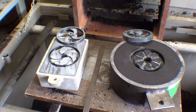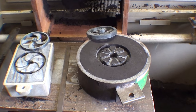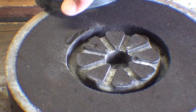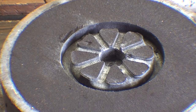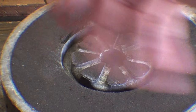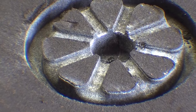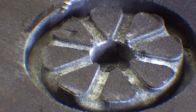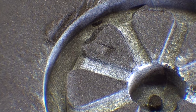Whenever a new pattern is made there's usually a test period where you want to see if it withdraws. I rammed up one half of a mold here just to play with it, and it did withdraw, but I had to do quite a bit of tapping in four directions. It's not too bad and would be usable, but right here there was a little tear-out, and right here is the worst part — but still usable.